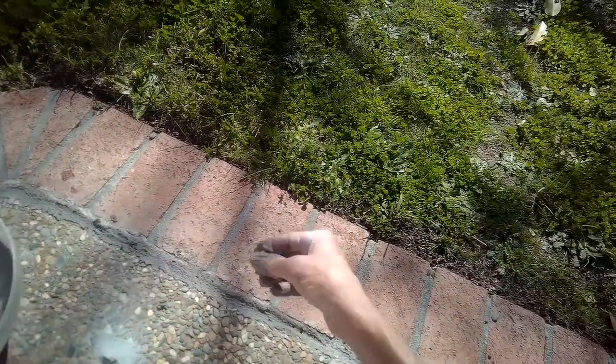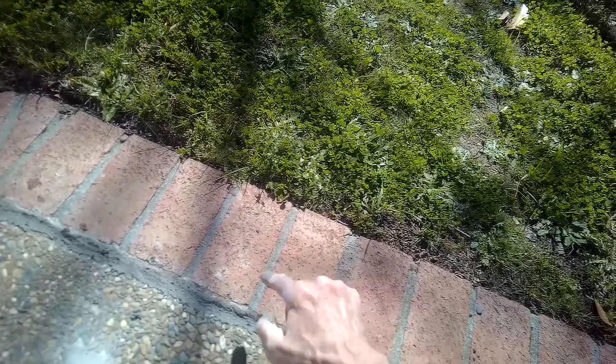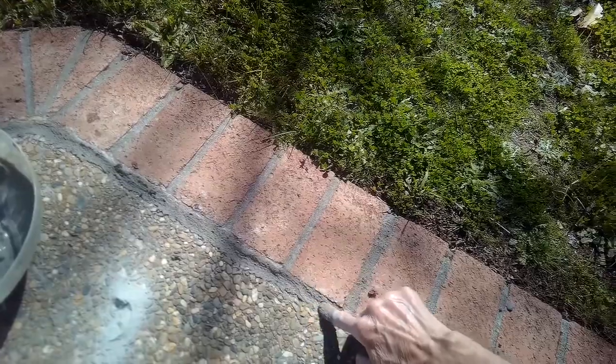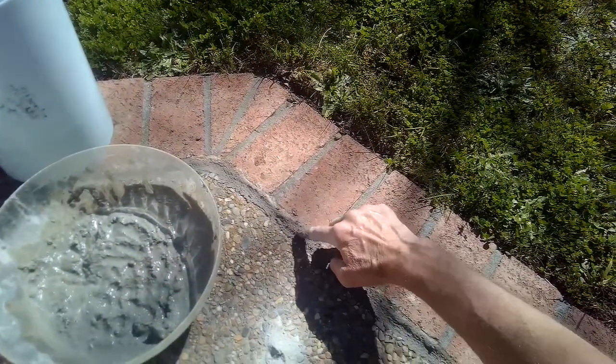I'm just trying to see wherever there's an open seam and fill that with mortar so that mainly water can't sneak in there. The water gets in and that water pressure can cause these cracks — especially if that water then freezes. It doesn't really happen here in California; you don't get too many days below 32 degrees Fahrenheit. But one of the phenomena of water when it freezes is that it expands — that's what bursts pipes — and it can also get into concrete or mortar and expand and cause a crack.